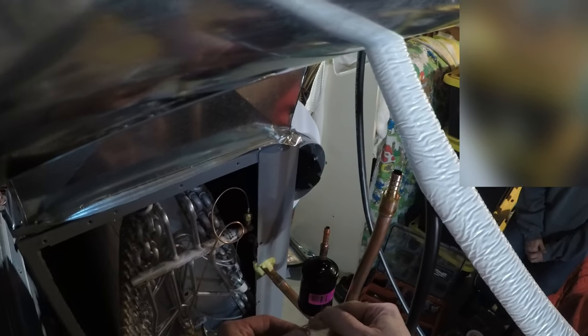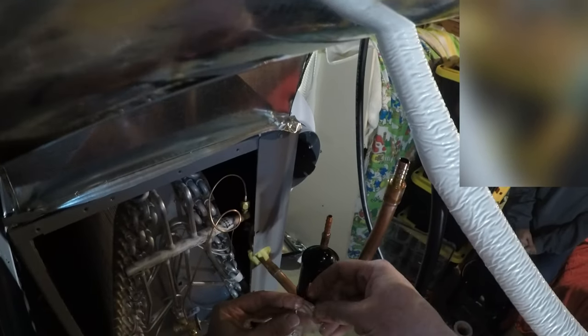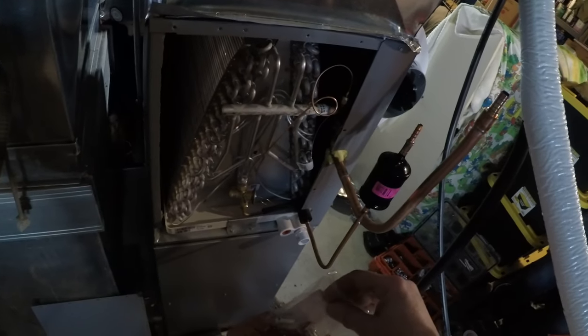So everybody wanted to hear about Yoga Pipe. Well, this is the job we're doing again, amongst others. With this Yoga Pipe, you get these little fittings, and you have to put these little O-rings on the grooves. For this to work properly, you got to do it properly. And you got these O-rings, and this little plastic coupler, washer, whatever. And you put the stainless steel piece in, like that.